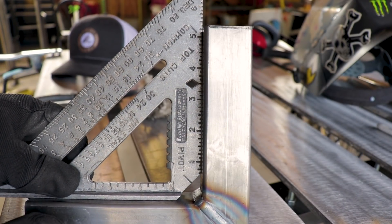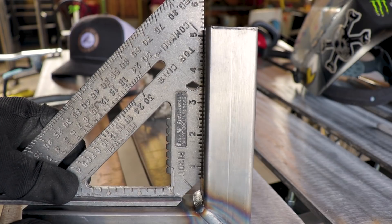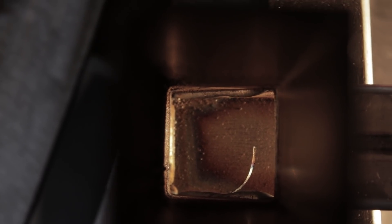If you look close you can see that it closed in just a little too much. So on the next one, if I was to adjust from this, I would probably run the butt welds to the outside first.